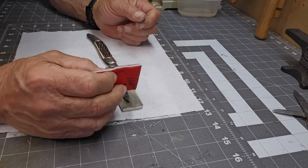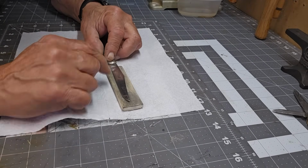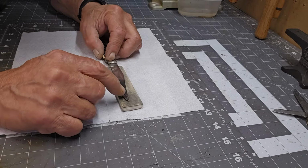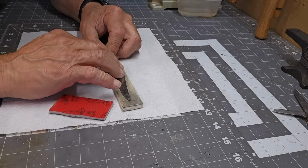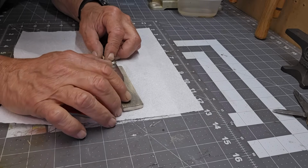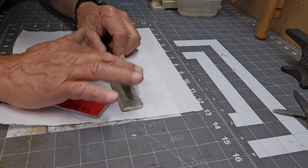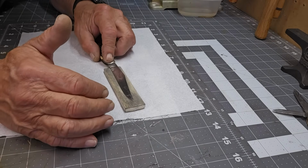Now, when you start doing this, if there's any rust on a blade, you're never going to get rid of it if it's really thick rust, because it's probably pitted the blade. Now, some people want to make them perfectly clean again. Not a good idea, because if you're going in that much on both sides, you're really reducing a lot of steel off the blade. Not a big fan of that.